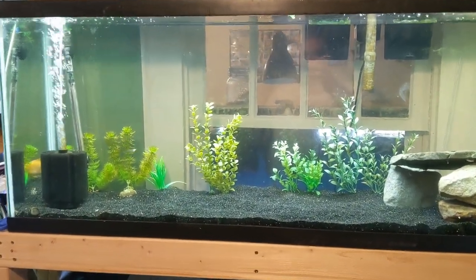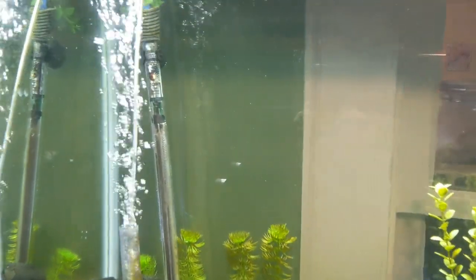If you guys take a look at this 55 gallon tank right here, if I come up close to this heater and zoom in on it a little bit, you can see right here that silver sticker has got little bubbles on it, as well as there are little water droplets along all the top of that. That's what we're looking at — water inside of a heater.